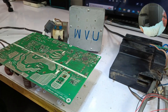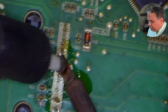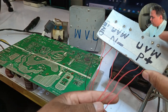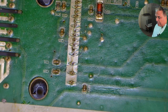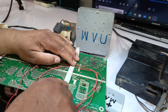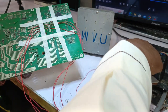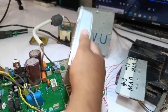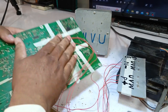I'll connect all the positive and negative outputs from the microcontroller. I'm applying paste to ensure optimal performance. Cleaning the old soldering is crucial because it makes applying new soldering much easier — old soldering can fail to adhere properly, so cleaning it thoroughly is necessary. Connections that are cut or not well-made won't affect performance as long as the three positive connections are with the positive terminals and the three negative connections are with the negative terminals. I'll apply masking tape to keep the wires in place to prevent them from touching anything that could damage the microcontroller. I've secured everything well, and I need to reattach the heat sink — we'll carefully place it back making sure no wires touch each other, keeping it facing up to monitor the system easily.